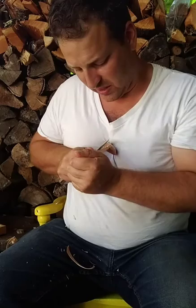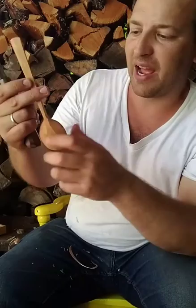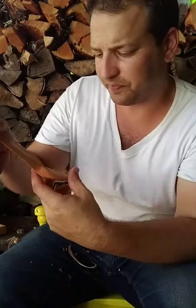You'll notice I've left the neck fairly deep at this stage, and that deep keel is just kind of insurance. If I've created a particularly narrow neck in the process of cleaning this up, then I have that material. And if I don't need it because I successfully cleaned this up and it's fairly wide, then I can reduce this keel to a certain extent.